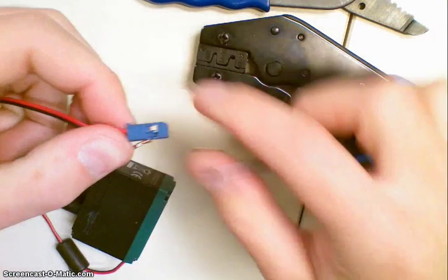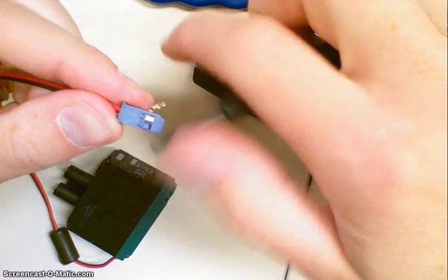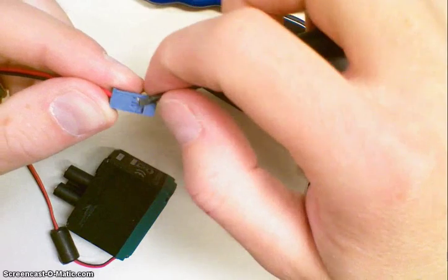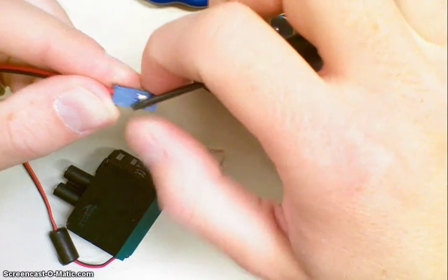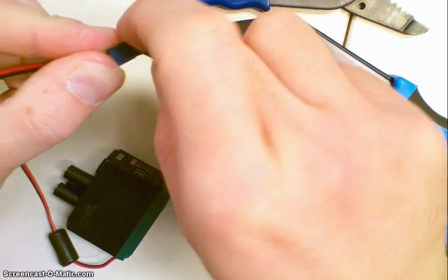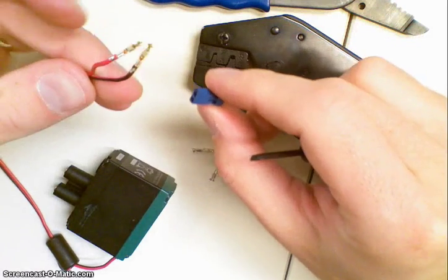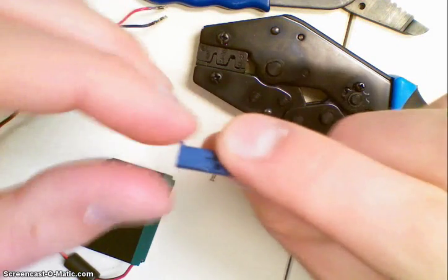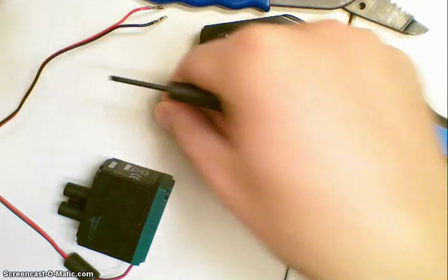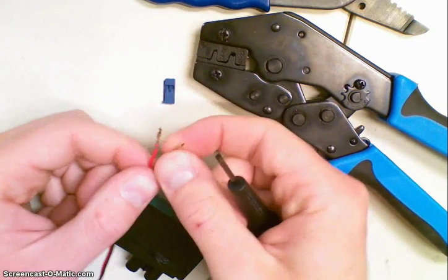Just like that — sorry it took so long. It's tough to kind of see on the film but hopefully this will be easier. I'll just lift my screwdriver in there, lift up, and then as I'm lifting I'm just going to slide that one out. So I took these two out and this is still intact. We can see that the tabs are still there, they're not broken off. I'm going to reuse this. When this slid in, the red was on the left side and the black was on the right, so I'm going to make sure I keep that the same.